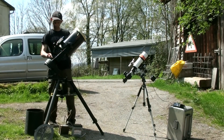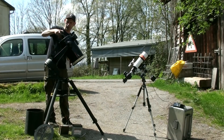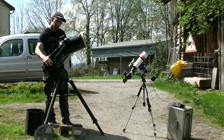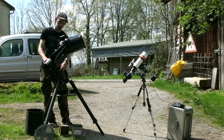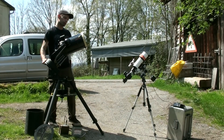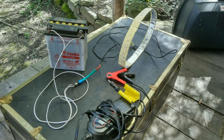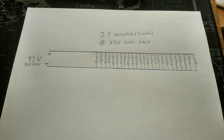Essentially the whole principle is kind of the same as with the small one — you have this axis and then the other axis. Here's the scope from the front, and back here is a 2-inch adapter, also for a Canon DSLR, so I can mount the camera directly. There's a motor built into the mount internally, and I power it with an external battery. Let me show you my DIY dew heater — it's basically just a band with about 25 to 30 resistors connected together in parallel, hooked up to my old motorbike battery. This works really well as a dew heater.